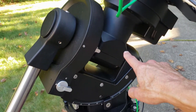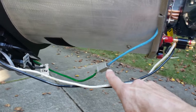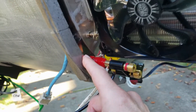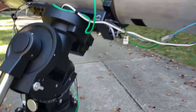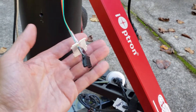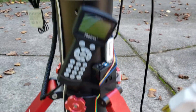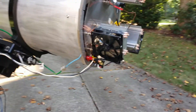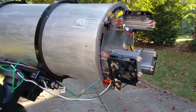One of the temperature sensors follows the green Cat5 cable up through the central mount and connects via a small RJ45 to a temperature sensor inside the telescope pressed up against the mirror — that's my mirror temperature. The other side is duplicated for the outdoor or air temperature. Home Assistant can read both values, compare them, and it knows when — via myself as administrator — to turn power to the Zigbee, which runs the cooling unit. It's fully automated.